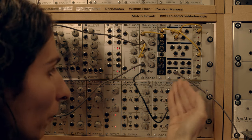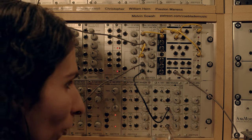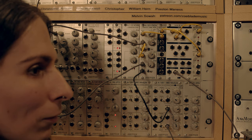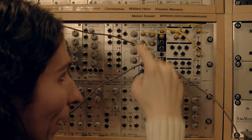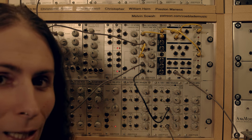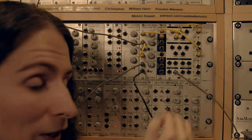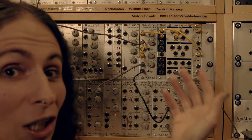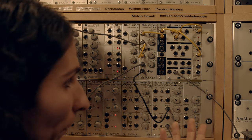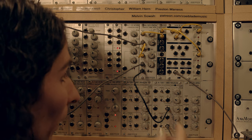So that's digital samplers, but this is analog, so what's going on there? Well, in terms of what position the speaker's in, that is completely analog, it's continuous, it doesn't assign a number to it, it doesn't say, well, we only care about several thousand different positions from there to there, and we're going to assign it one of those. No, it will work out exactly where the speaker is and move it to exactly that position quite continuously. That's great. So as far as the physical position is concerned, it's analog. But as far as how often it checks is concerned, that's kind of equivalent to digital. As far as how often it checks where the speaker should be, it will do it a set number of times every second. And what dictates that number is this knob here.